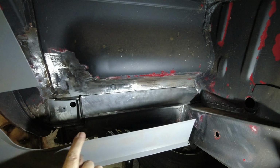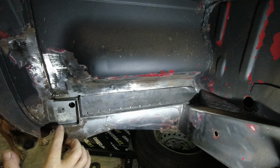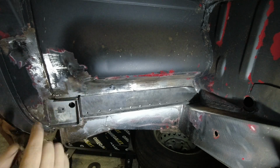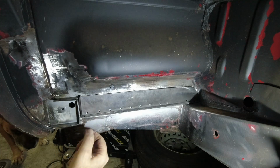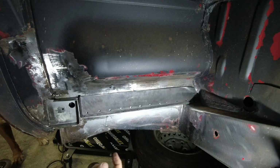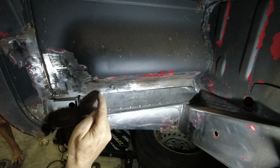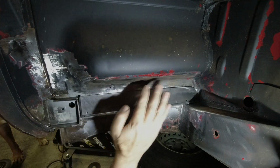And this is your bulge here, yeah? Seam weld, seam weld, seam weld. Seam weld means just all the way along. So that's how I'm going to get seam welded. Plug welded, these are already spot welded, yeah? So plug weld all of these, and we're just going to put dimes on there, spot welds, and then close it all in and then clean it all back.